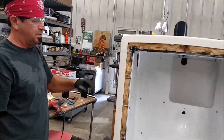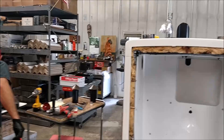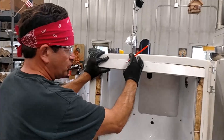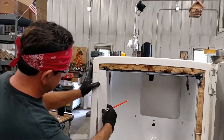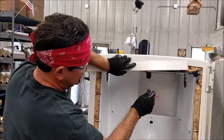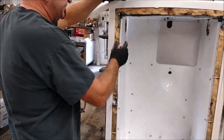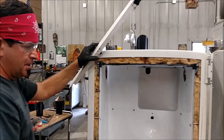When you remove the plastic on the edges, normally when we take that out — it's more like a resin-type fiberglass material — you can go to any of your home box stores and get regular metal roof flashing. Anything that's a thinner gauge is easy to work with. You make your pieces and actually slide them right in here. I'll make these pieces, they'll slide up in here, and I will use the lip of the flashing, drill it, and rivet these pieces. That way all of this is now metal and it's all protected so there's nothing — no sparks or anything — that can get in there to catch the unit on fire. Then you can put your gasket on there.